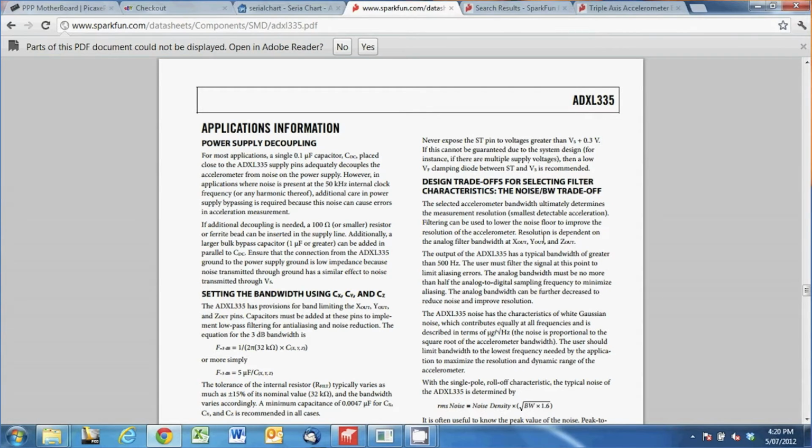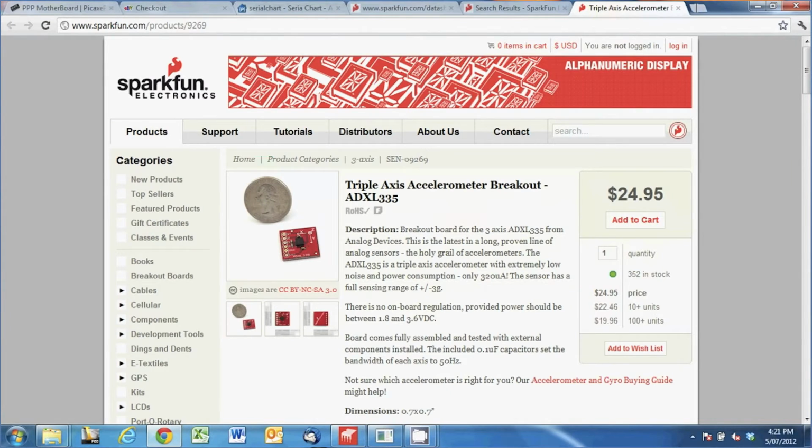So the recommendation is that you take one battery out, maybe put a jumper across there, like an alligator clip or some sort of a blank battery or a flat one or something like that, or otherwise use some sort of a 3.3 supply. But I know it does work with a 4.5 because I accidentally tested it without checking the data sheet first. So we'll have a quick look at the screen now.